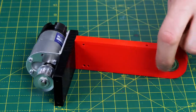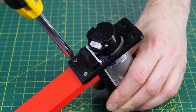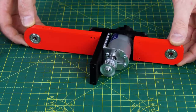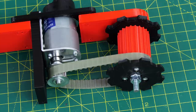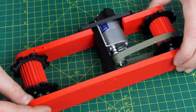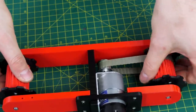We've got a bit of 3D print here with a bearing in that's going to hold one of the track sprockets and this makes up part of the assembly. Because of the motor in the middle and the clearance with the track we've got a little bridge piece that goes on and allows the motor to poke through. On the other end is another piece with a bearing in which is going to hold the track on the opposite end. So I can now put my two sprockets into my two bearings. That pulley on the motor is going to be driving one of the sprockets with a belt onto that T5 shaped bar on the sprocket. It's a 255mm length belt but I trialed and errored the thickness of the motor bracket to get the tension just right.